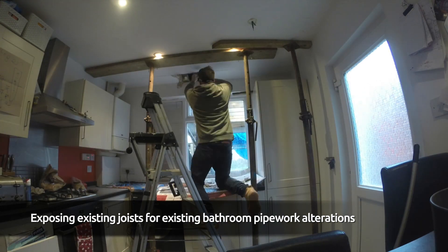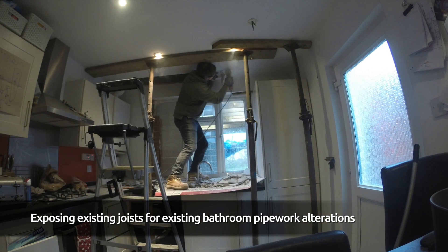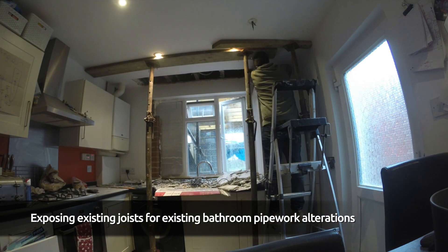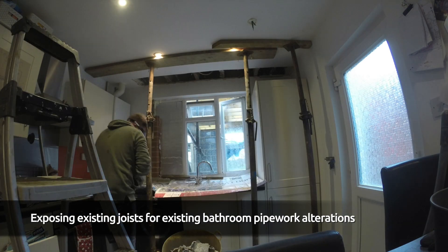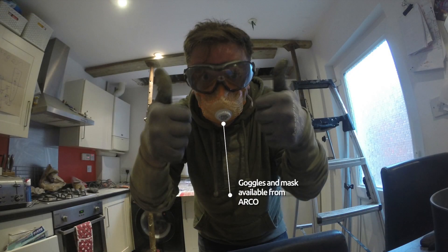There's Steven — he's cutting out the inside. Why is he cutting out the inside? We need to access it because we've got to put the joist ends into the steel beam, into the web of the steel beam. So he's cutting that out, and at the same time I've got to do a little bit of a plumbing alteration here. Well done, Steven.